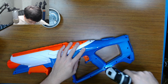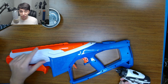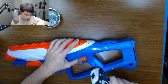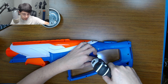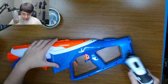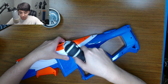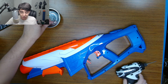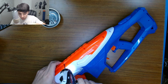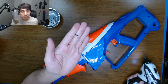They are a pitch of 1 millimeter, and the reason why that's important is because the ones in the orange parts, which is a polypropylene, is a 1.5 pitch. That means between the teeth. The reason for that is only because the polypropylene is a little bit softer. So you get some impact resistance, but it would probably rip out on whatever tool they're using to assemble these things, because these are the screws that you just click a thing and it automatically loads the next one and you just go all day. Take that however you will. So all of these screws are the same. They're just a bigger pitch.